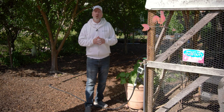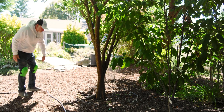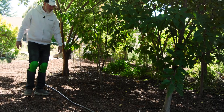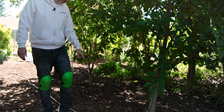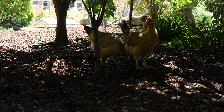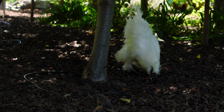Now we're going to run our first watering cycle. When you do your first watering cycle, it's the perfect time to walk the system and check for any problems. Check connections and joints for signs of any leaks, check all the threaded connections at your head assembly, and look at your drippers or emitters to make sure they're dripping as they should be. If you're tired of carrying around heavy hoses and watering cans to hand water your trees, you now have all the knowledge you need to build your own drip irrigation system for trees. You can see how easy it is to take back that time so you can spend more time enjoying your trees and less time trying to get them watered. If you'd like to learn more before you get started, check out our Getting Started With Drip Irrigation playlist. If you're ready to dive right in, you can check out our tree drip irrigation kits.